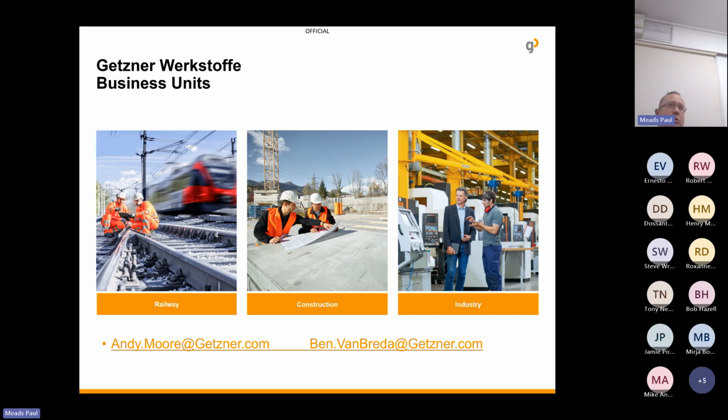I was sent a document. I'm not using it yet. I have the meeting on Friday, I think, with the person who created it. But it was a study by Network Rail, and it looked at the 40-year lifespan of the rail, and it showed you all the maintenance that needs to be done over that period: the tamping intervals, the grinding, the re-railing, all of these things for 660 yards. And then compared it with having under sleeper pads.